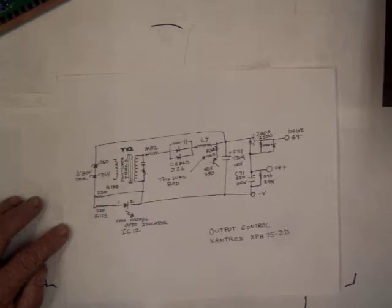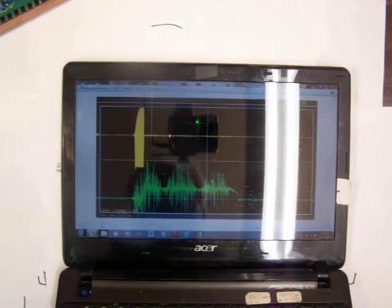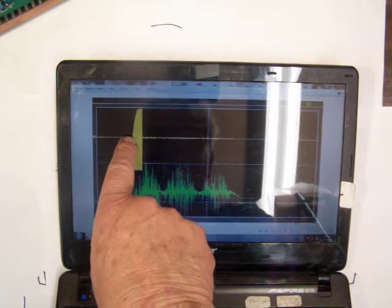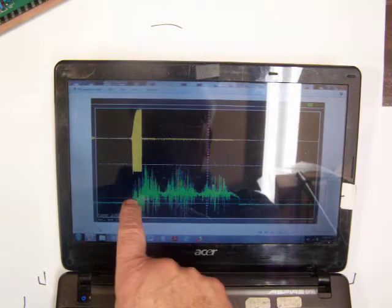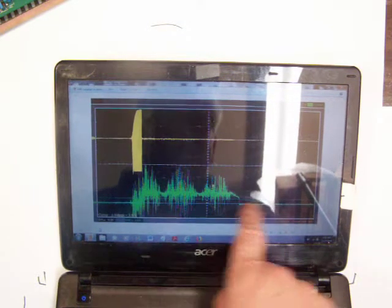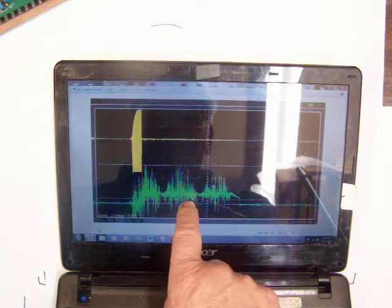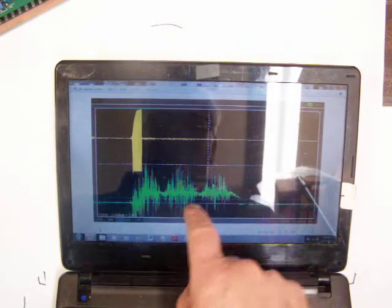And let me show you what the signal was on the opto isolator. I don't know how well you can see this, but this is the power that's going on the transformer. So anyways, the switcher starts working, and then this opto detects a high voltage and it shuts it down. This is when we finally run out of every little bit of power that was powering the opto. But it would just keep doing this, so every second it would burst, turn on.